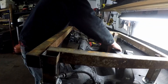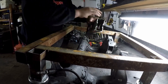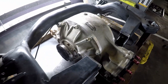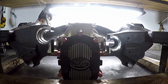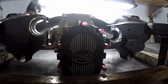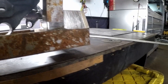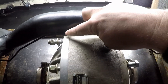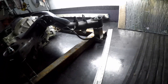I gained some muscle lifting the subframe and jig up and down, cutting everything and moving the differential around — this stuff gets heavy when you have it all together. But there we have it: the differential almost fits. It's fitting in between where we cut, it's in the subframe, but it's not all the way forward. We need to line it up, and you can see the jig isn't touching the ground because the front of the differential is holding it up.